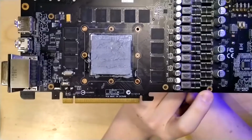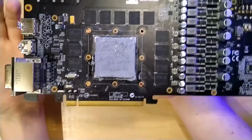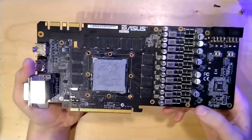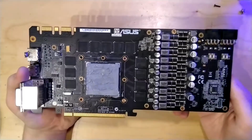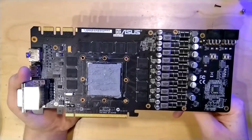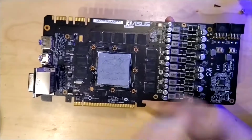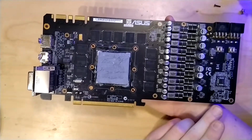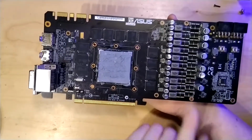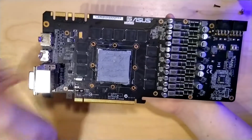Our high-side MOSFET has a rating of 76 amps, as I just said. I have this number out of a datasheet that I found online. I can't really say if this current rating is actually the current rating we will have on here, because I couldn't find out if this current rating is for 5, 10 or 12 volts. So I would guess it is for 10 volts, and these MOSFETs are probably driven by either 12 or 5 volts. I can't be sure, really.